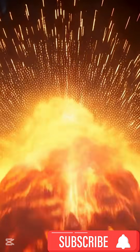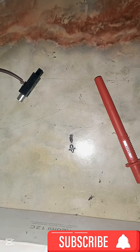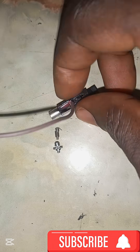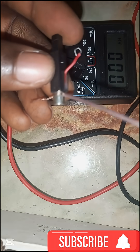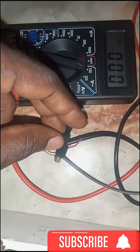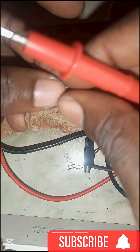Just like quartz stone, when subjected to a compression force, internal dipoles align, resulting in the polarization of the material, which in turn produces an electric field and an electric voltage. The current is tapped by two electrodes connected to the opposite sides of the lead zirconate titanate.